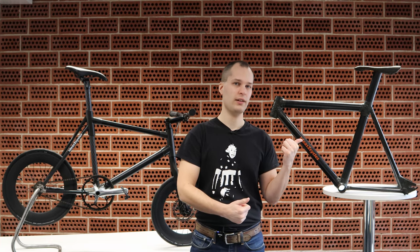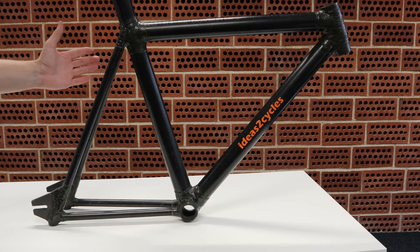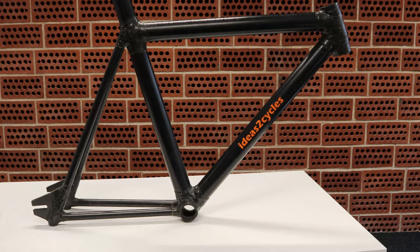With this frame we used large diameter tubes all around in the front triangle — they are 50 millimeters in diameter. Our simulation results show that the down tube is the most important one for torsional and lateral stiffness, but actually this prototype proves that the seat tube and the top tube are important as well, and having a 50 millimeter tube in all of the main frame tubes makes this frame really really stiff. I raced this frame at a crit race and the power transfer to the road was quite good, but the frame is very very stiff so it's not that comfortable for longer races. The whole frame weighs only 1.5 kilograms, and you have to keep in mind that the seat post and seat are included in that weight. Building the bicycle frame by wrapping carbon fiber around the joints is a very fast and easy way to build a bicycle frame and the quality of the laminate is quite good.